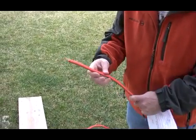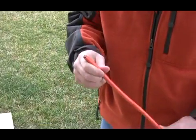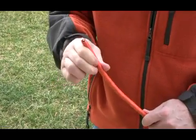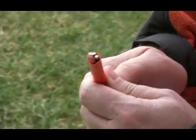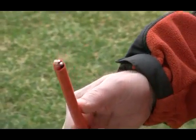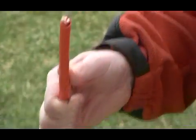This is the wire that I used to wire the receptacle back to the breaker panel. It's a 10-3 wire — it's pretty heavy gauge, pretty stiff. It's three wires plus the ground, and this is the type of wire that you want to use for the 30-amp capacity. We'll go back to the panel at this point.